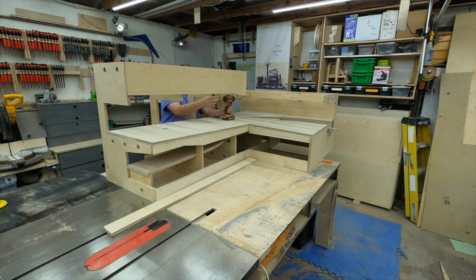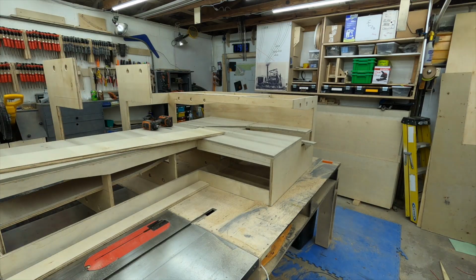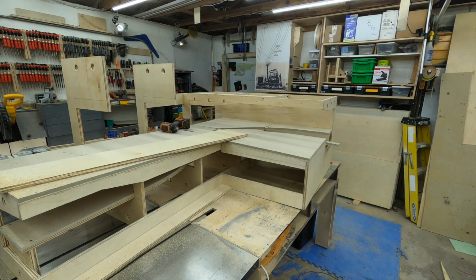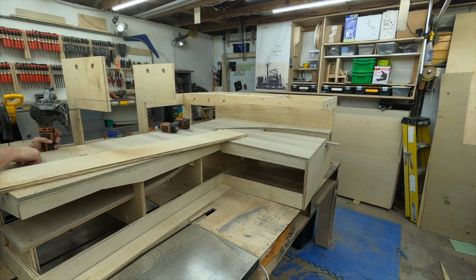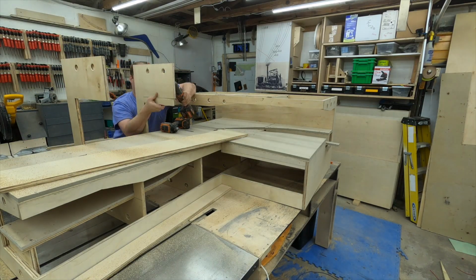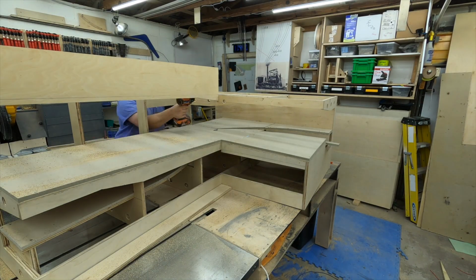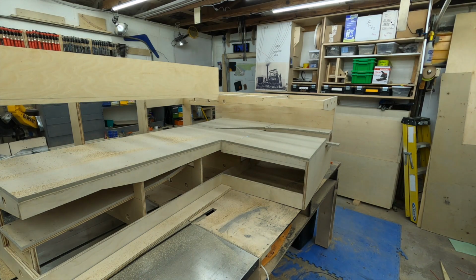But ultimately, if he has to remove it, he can. And that's kind of the beauty of everything that I build with my style of model railroad benchwork: you can actually take apart about 95% of what I build with just a couple screwdrivers or a little bit of a pry bar. So I avoid using glue where I don't have to. Obviously if I'm building curved benchwork or something, that's glued together. But joints and stuff, they're just screws, and that allows a little bit of flexibility in the layout.